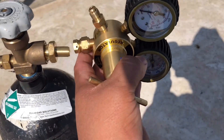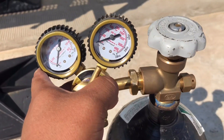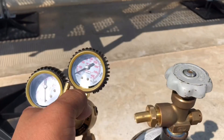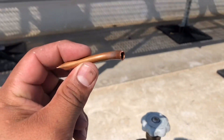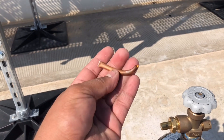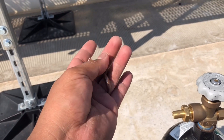Don't drop your nitrogen regulator. This goes like this, and this guy right here — it fell about two and a half feet and that broke off. Looks like it's time for a new one. I've got to go to United Refrigeration to get a new regulator and two more nitrogen tanks, and I'm going to see if I can get a coupling for this pipe. I'd rather do a coupling because I don't like the way a quarter-inch pipe swedges. So probably just do a coupling — make a couple bends and we'll fix that. Let's go to United.